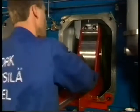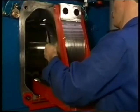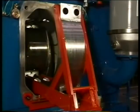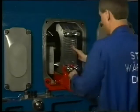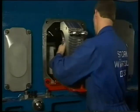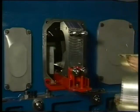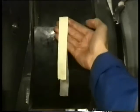When the upper nuts have also been removed, both bearing caps can be pulled out. The bearing shells can be removed from the bearing caps by hand. Wrap the shaft with a piece of rubber for protection and for closing of the lubrication oil channels in the crankshaft.